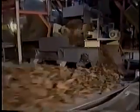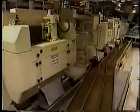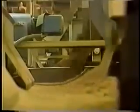These components are then blended together with the RL and BL according to the formulations for each cigarette brand. That partial blend is steamed and then goes to the cutting line, where it is cut to a uniform size and sent to a rotary dryer to reduce and control the moisture content. At this point, IS, ES, ET, and bright burley Oriental small lamina are added in brand-specific formulations, and the total blend, all the tobacco that goes into a cigarette, is now complete.